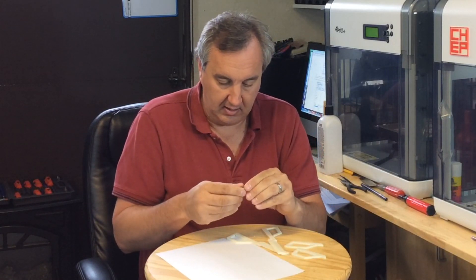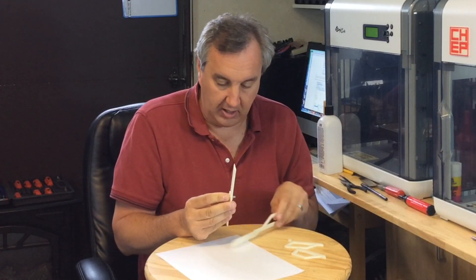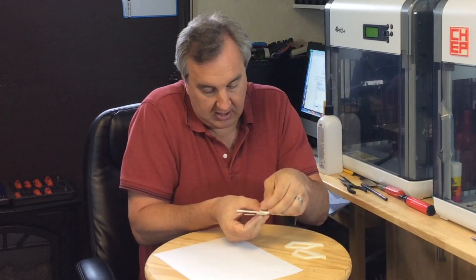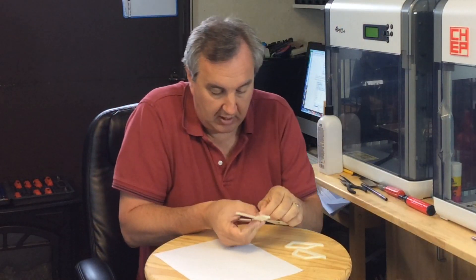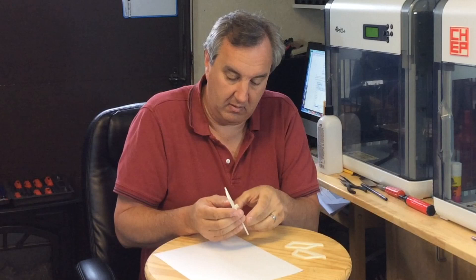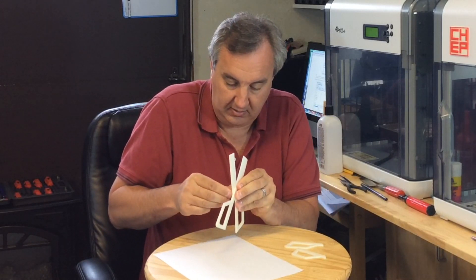What I did do is I checked it while it was cooling and figured out that this was the right size bolt for it. I got one long enough, and I got a plastic nut, and then a second one. So I'm going to put the plastic nut on the screw, and then I have a second one that I'm going to put on so I can tighten nut against nut, because these things need to be fairly tight to stay tight. So I got it tight, then I'll put the second nut tight against the first one, and hopefully that'll stop it from loosening while I try to cut.